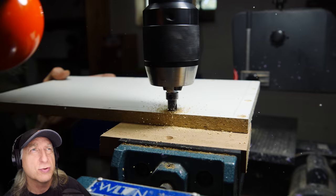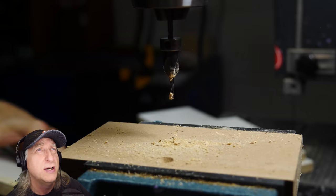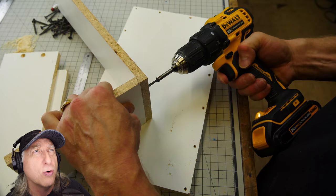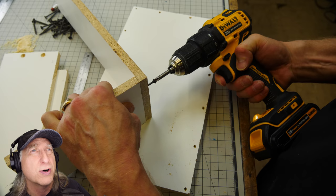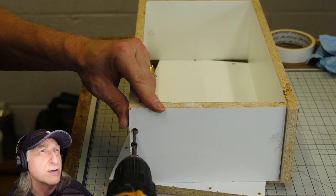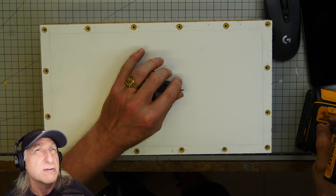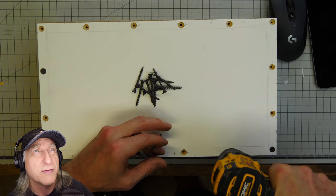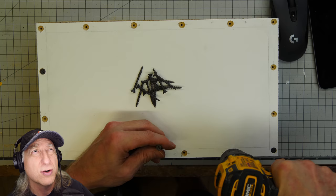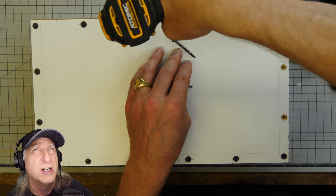You want your mold box to be nice and square. I'm going to screw this mold box together because I don't have an existing one that's the correct size. I pre-drill and countersink all the holes because it is particle board — basically crappy low-grade material — so I have to be particularly careful so that I don't split the material. I screw everything together with inch-and-seven-eighths drywall screws.